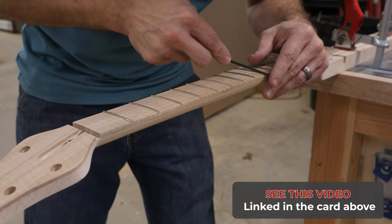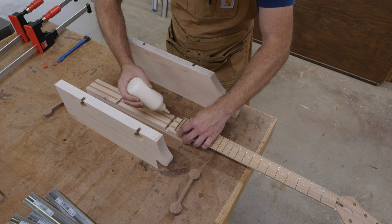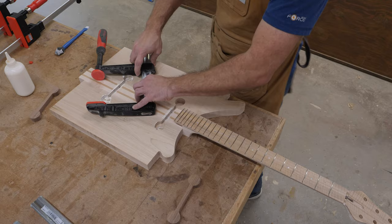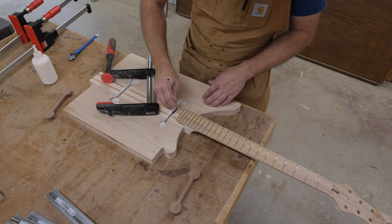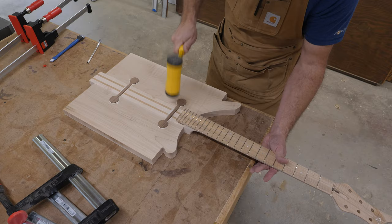As I glue all of this together, I want to make sure that I don't put too much glue where the heel of the neck and the wings of the body meet, because that's going to be a difficult area to clean up if I get a lot of squeeze out. Now where those dog bones are, I'm really not concerned — I slap as much glue in there as I need to to get really good coverage because I want those to hold very tightly and pull everything together. Before breaking out the clamps, I drive these dog bones in place as deeply as possible with the dead blow hammer, because it's faster than using the clamps alone. With PVA glue you generally have to work a little bit quicker.